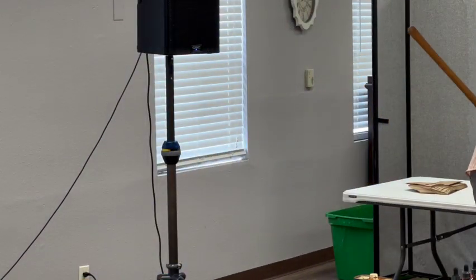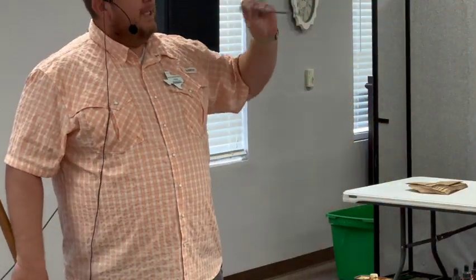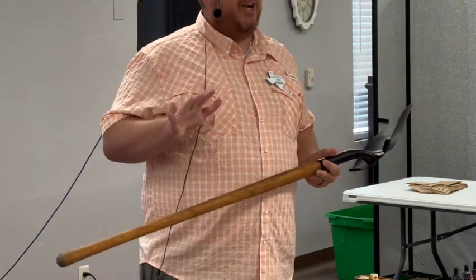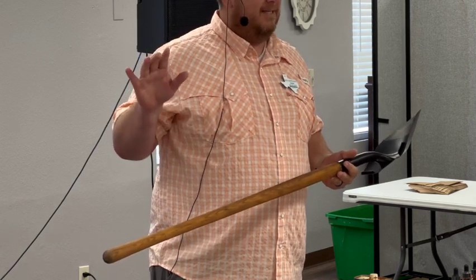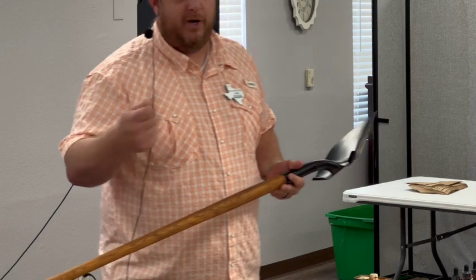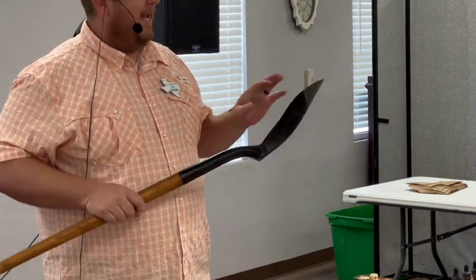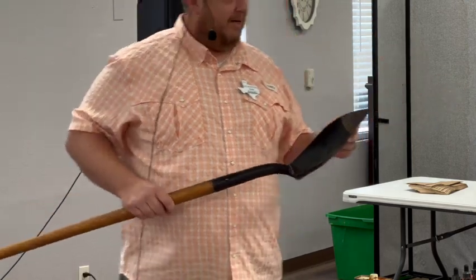How did you sharpen it? Files. The cool thing about this is a lot of this stuff you probably already have in the garage. This one is a very fine file, so this would be for an axe — I wouldn't use this on a shovel. If someone is going to watch you file, 100% only file in one direction because files are made to cut in one direction. If you lightly drag it backwards, even barely touching, that's a big no-no. But if you do it by yourself in your garage, whatever you want.